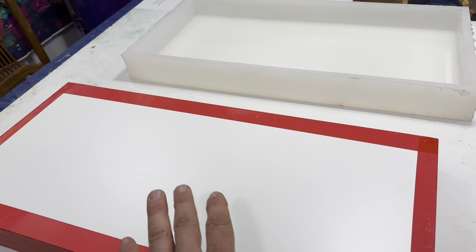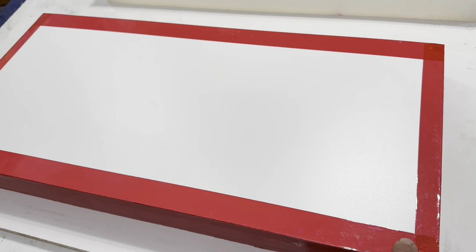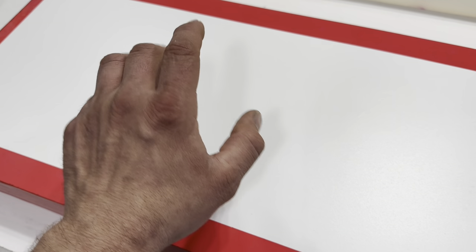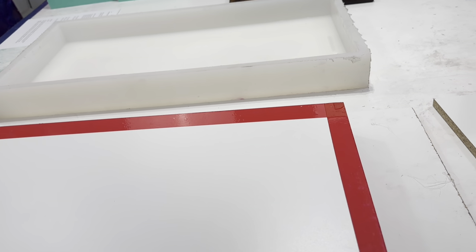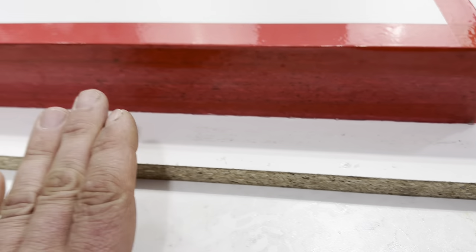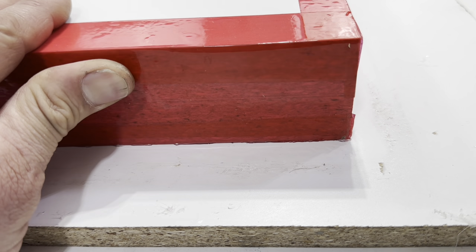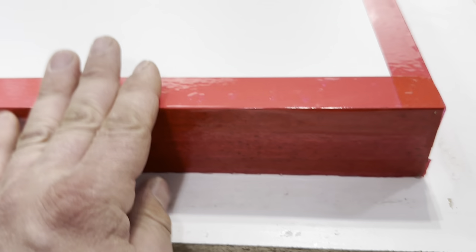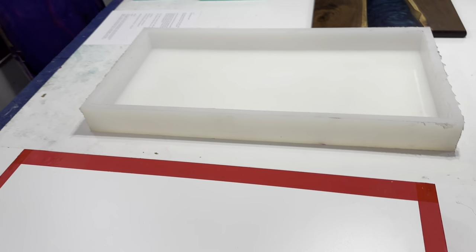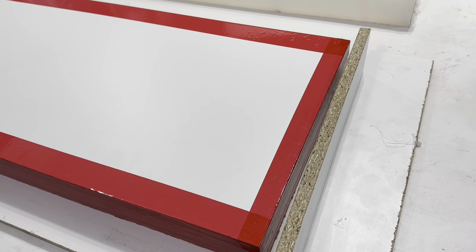Okay, this is chapter two. The block we made outside is 24 and three-eighths by 12 and one-eighth, all screwed together. This is the top side of the block with no screw holes in it. In the next part of the video you'll see me tape over all this melamine. The reason we tape over the melamine is because it's very porous and we don't want it to stick to the silicone.